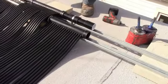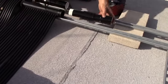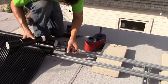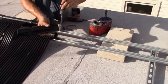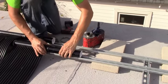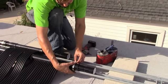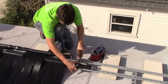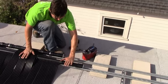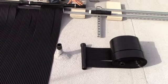Headers in place. Next we'll glue another intermediate pipe. Here's our intermediate pipe once again — our two inch slip collar and number 44 hose clamp. Slide that together and lock it on once it's glued. Once again glue our female side first, then our male side. Sometimes you get a little drippish. Make sure your slip collar is on, slide it in and bottom the fitting out. Slip collar in the middle. Number 44 hose clamp — usually put the gear clamp on the back side. Clock that down. We have the end of the last intermediate pipe here, already installed, clamped and done. We're going to take our next one and lay it in place.